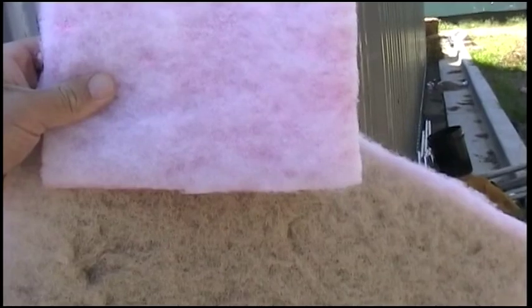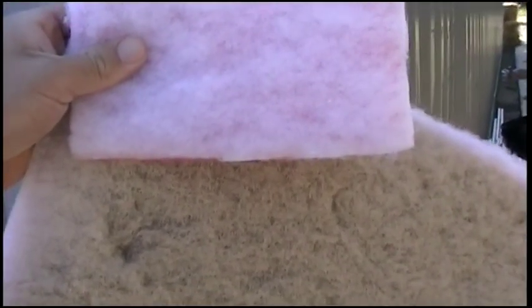Again, I'm here maybe 4 or 5 days after we did the startup, so I don't know when the filter got like this, but you can see all the stuff coming off, all the drywall dust and everything. My opinion, these filters need to be changed now. So I'll ask the owner if they want us to go through and change the renovated classroom area.